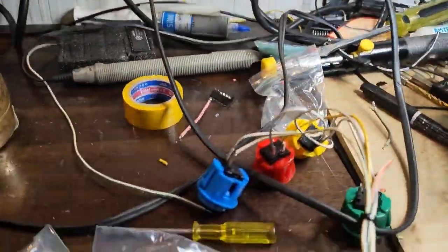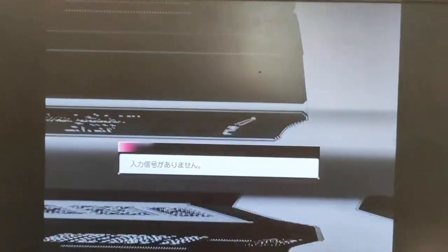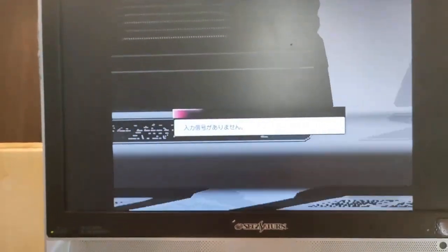All right, so I found my screwdriver here, and I tried to adjust the sync on this, and unfortunately, I can't get the sync to line up here. You can see that it says Battletoads in there, but none of the other buttons are working, and like I said, adjusting the sync here on my Super Gun, I'm not getting anything at all. So I'm wondering if maybe this is similar to the, what is it, like older Sega boards sometimes, or even the Taito boards where the sync just doesn't work with most monitors.